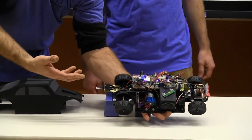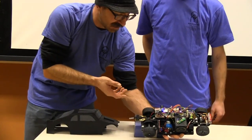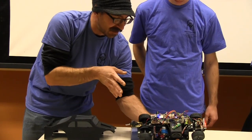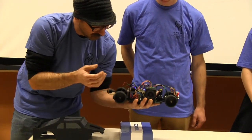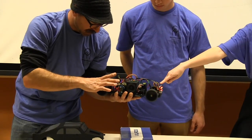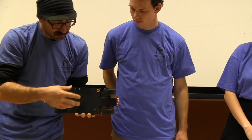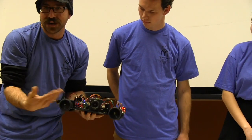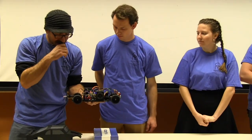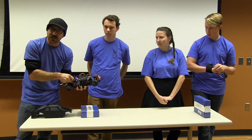The entire car was constructed using inexpensive off-the-shelf parts, mostly ordered from Amazon — pretty much everything is six dollars or less per piece. The entire car is 3D printed, from the H-bridge mount to the motor mount, rear suspension, proximity sensor, and LED scanning bar holder. Everything is well-constructed for replaceability and repeatability by anyone wanting to recreate it. The rear drive system is adjustable front to back so we can get the right tension on the belt system.